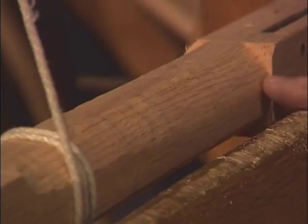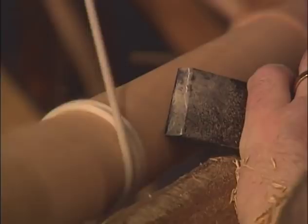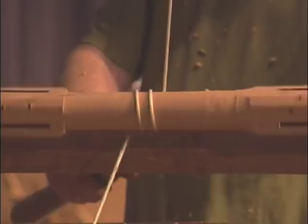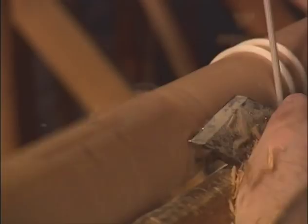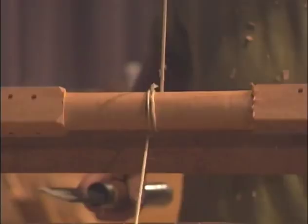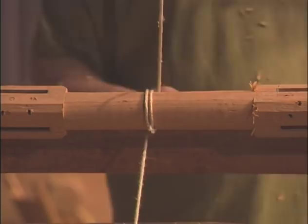That's beginning to define that piece. I'm starting to appreciate that as each chip leaves the surface, it burnishes the surface just before it leaves — and that's why you get the shine. So now I've essentially got the cylinders defined, with these horrible ragged chippy corners. And now I cut that little transition — that's the Victor Borgay, right?